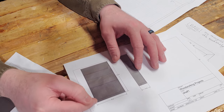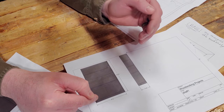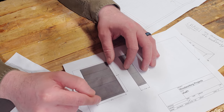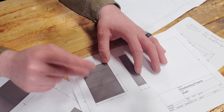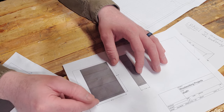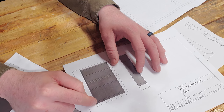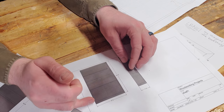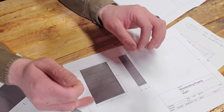This is the original one I came up with. I started at the bottom, because you need some kind of step-in for a toe kick. I thought I'd make these two inches, just because it's twice the size of the four-quarter boards I'm using. I did a rectangle on the bottom of two inches, three feet across, and then I put another for my shelf — that's three quarters, because after milling a one-inch board, you end up having about three quarters.